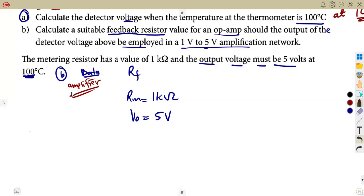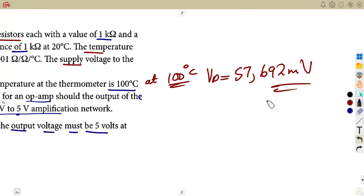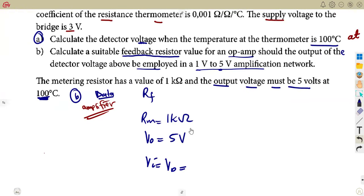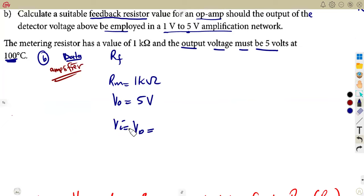For the amplification to happen, we need the input. What is our input? The input is the output that we had from the detector. Like I said, the input to the amplifier is the output. Since we are working at 100 degrees Celsius, we have VD corresponding at the same temperature that our output of the amplifier is at. Remember, we're given 5 volts at 100. So the V in is your VD, the detector voltage that you calculate from the output of the transistor, which becomes your input to the amplifier. So that was 57.692